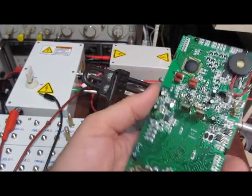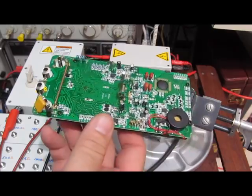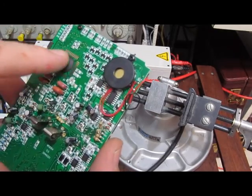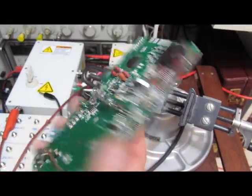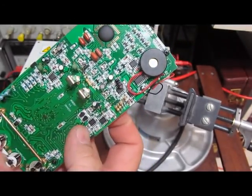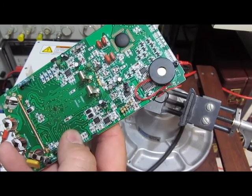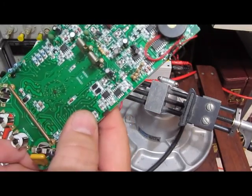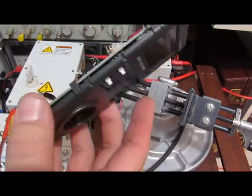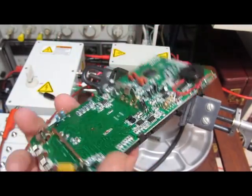I pulled the Maztec apart. This is the MS8264, and it's actually quite a bit cleaner than the other Maztec I got from Harbor Freight. It doesn't have near the features, so you'd expect it to be cleaner — the other one has two chip-on-boards and a lot more wiring. This is kind of a no-frills meter. I started to ohm it out a little bit — these are the attenuators up the sides. This last resistor, which should have been 10x bigger than the one next to it, appears to be a dead short. Can't tell for sure without unsoldering it, but I'm really not in the meter repair business. I assumed these meters would meet what they were rated for — and yeah, this one doesn't cut it.